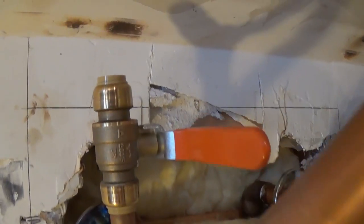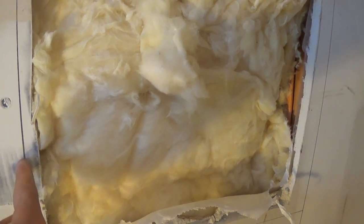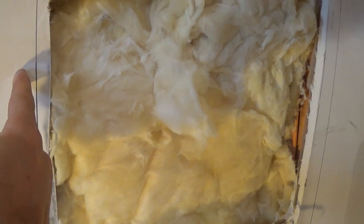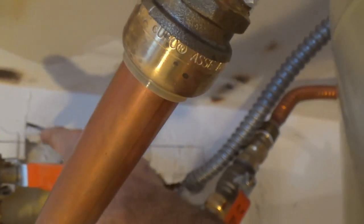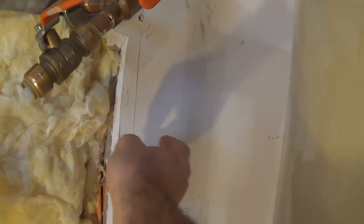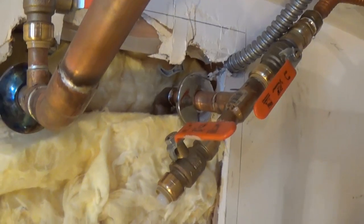The first thing I did was cut out a line the way I want the finished hole to look. I made this a little wide so it will go about halfway, or at least half an inch, into the stud here. Over here there's no stud. Up here there is a board that goes across, so I'm just going to cut it here and fill this area in. Over here there's also a stud, so the drywall will be attached to that stud. This stud I'll have to somehow secure on the bottom, and we'll figure something out in the middle.